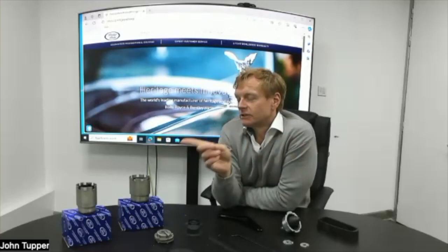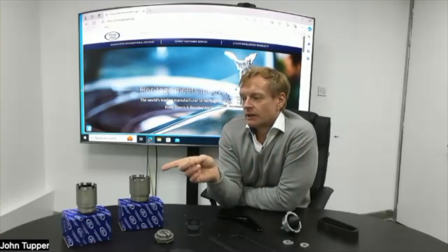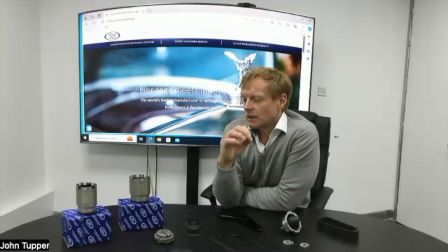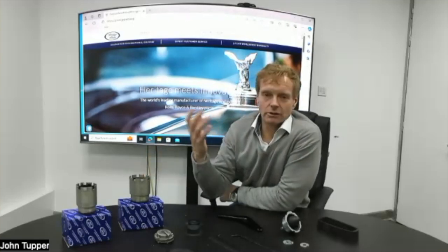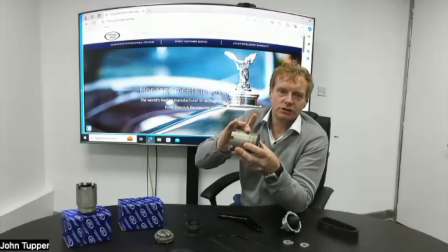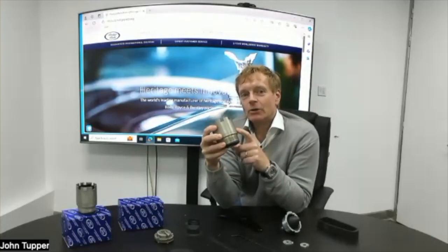What's special about how you made these? The guys who did this are a really lovely supplier — they are OEM suppliers working with companies that supply Mercedes, BMW, Volkswagen, and many others, even Lamborghini and trucks. These guys are absolutely top notch. One of the interesting things when you get a product in is you do a lot of measurements. With engineering you have a tolerance — for example, something specified at exactly three inches is allowed to be 2.997 to 3.003 inches, plus or minus thousandths of an inch.